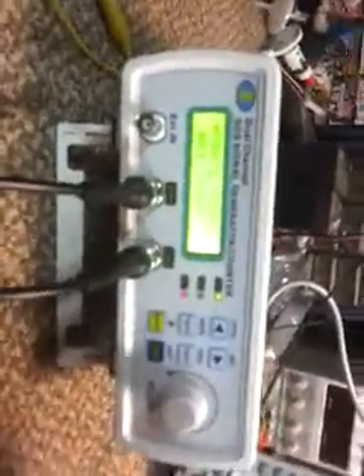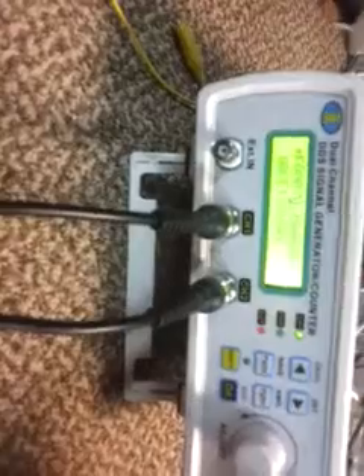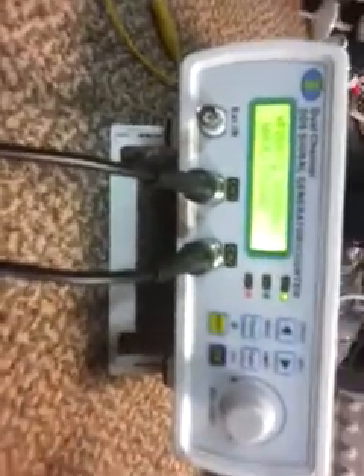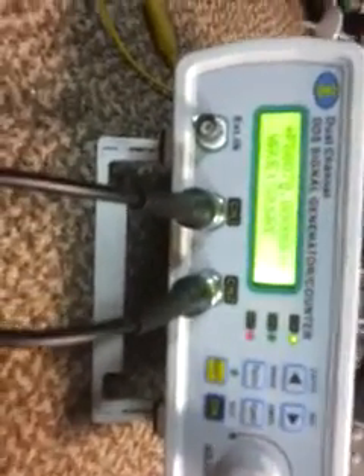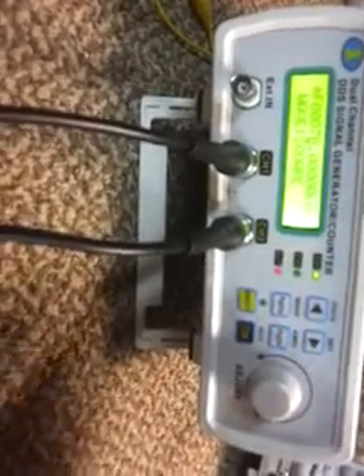The objective is to set your primary coil just a little bit shy of the actual resonant frequency. The reason is that a streamer — the big lightning bolt — coming off the coil will actually detune it to a lower frequency. So you want to keep it slightly out of tune so that when sparks are emitting from the top of the coil, it will come into tune. Think music: resonant frequencies and harmonics — that's how it works.